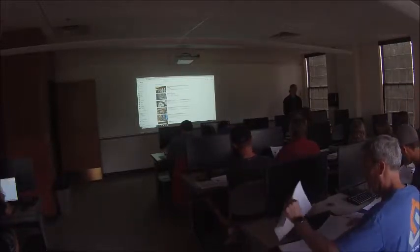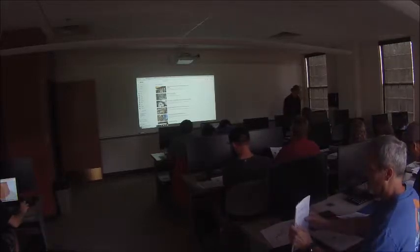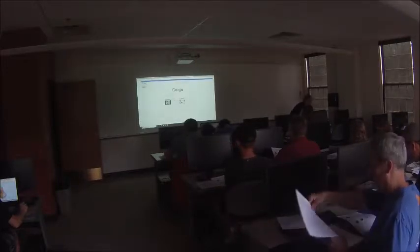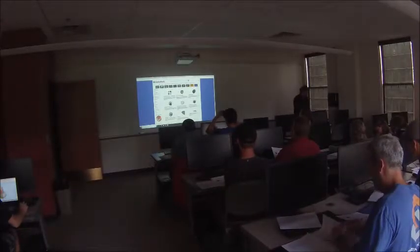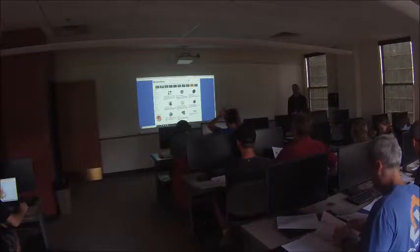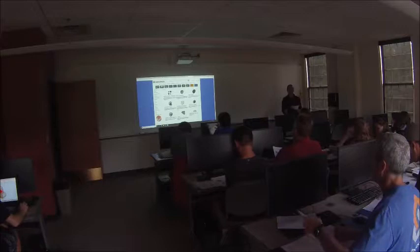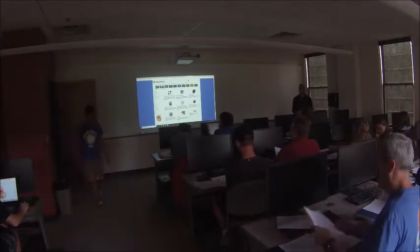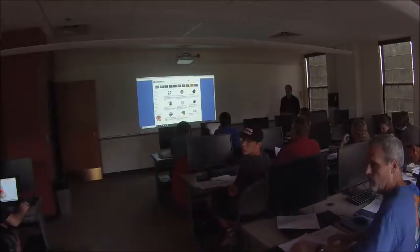Probably the most common one, I would say, and the simplest, cheapest wheel is a wheel that has a molded rubber tread. I'm actually gonna pull some of these up. And it's shown there. So typically a rubber treaded wheel is made of plastic. It has some sort of a hub and a bore that you can attach hubs or shafts to. That allows you to drive the wheel, and then the tread is made up of a typically fairly soft rubber that's just molded right onto the wheel.